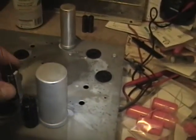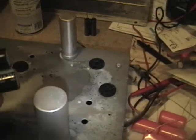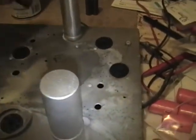For the electrolytics for this project, I want to restuff the cans — which means they've got to fit inside here. I had some on hand but these aren't going to fit, and even stacked vertically they won't fit. TV caps are a bit harder to find than radio caps because they generally are higher voltage and higher capacity — in this case about 40 microfarads at 450 volts. But I did some searching online and found that the same manufacturer has a line of skinny high-capacity caps: same capacity, same voltage, but about half the diameter. So these guys will fit nicely.